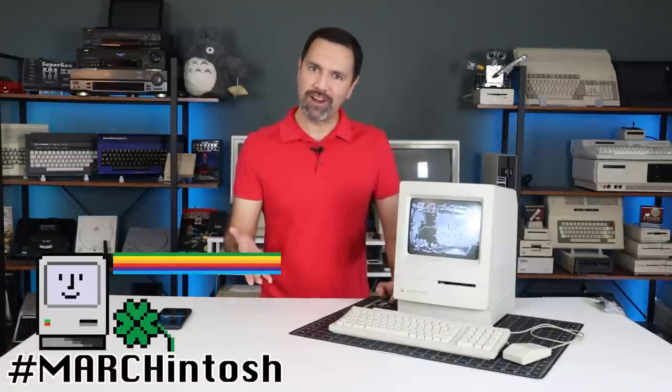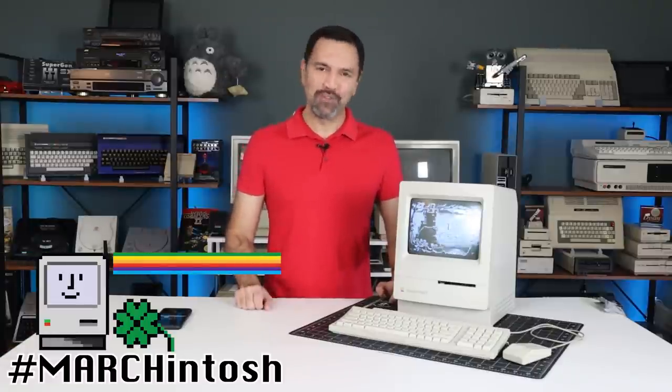Just, wow. I can't believe how well this poor abused Mac cleaned up. It's almost like it's brand new again. I could not be any more pleased with how this project turned out. We also learned a thing or two, the first being that surface mount caps are not to be feared. Second is a warning to anyone considering buying a classic Mac from this era. Even if you find one in working condition, be prepared to immediately clean, recap, and always, always check that battery. Now get out there and save one of your own.